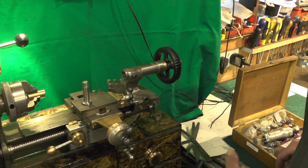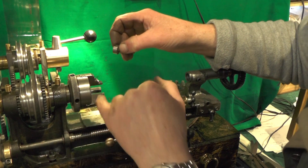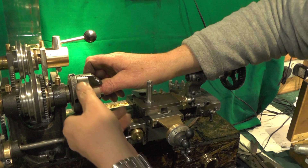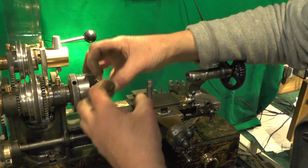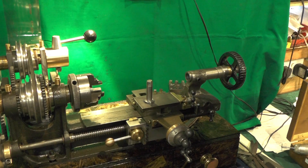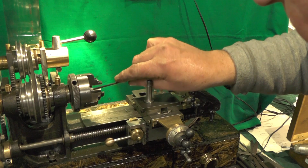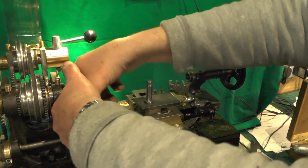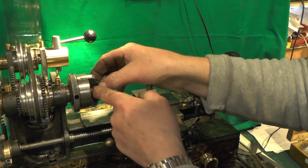There's going to be nothing clamped in the jaws, I know. So what I'll try to do - the jaws are that long but only grip on the front portion - I've made this steel ring to clamp in the back with the clearances in the jaws. That puts pressure on the jaws as though there's a workpiece in there. I clamp that up solid, then I just have to grind up to where the jaws are serrated, and the rest is clearance at the back. I've got nothing to lose - I can either scrap it now or try to make it better.